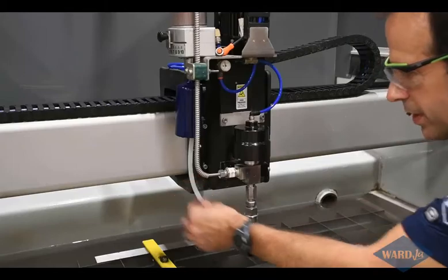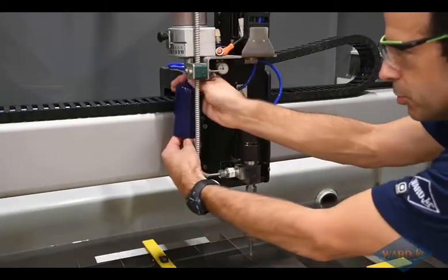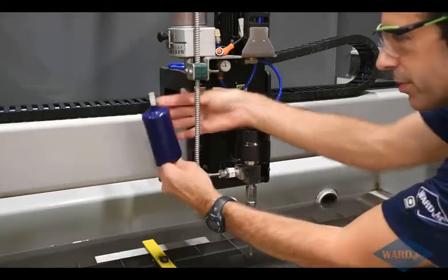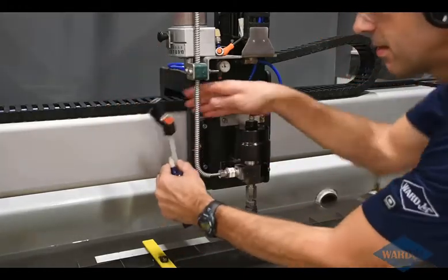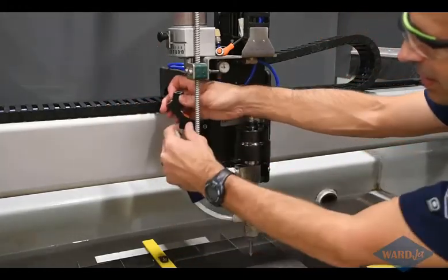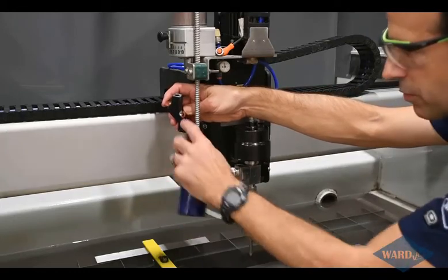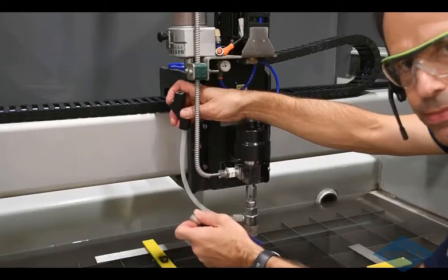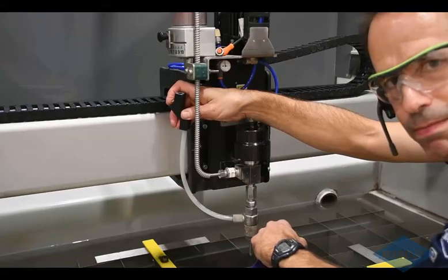And going back this way, this feeds up to our mini hopper here. Underneath this blue cover, we have an anti-backflow device, so should you ever get water going back up the abrasive inlet, this has flaps in it that should allow water and abrasive to come out there rather than getting all the way into your mini hopper. So let's take a look at those internal components now.